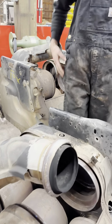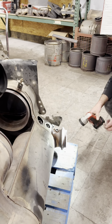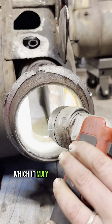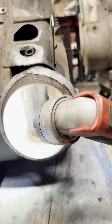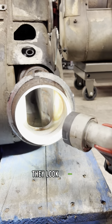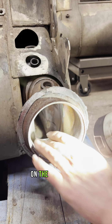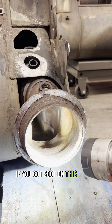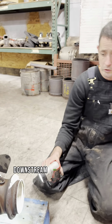Coming around now with the flashlight, you can actually see the outlet of the SCRs down here — it's kind of hard to get light in there, but they are back about right here. These particular ones look normal; they're nice pearly white with no soot. One of the other things to look at is the outlet here — it should be pretty well clean. If you've got soot on this outlet, then you've obviously had pass-through through your DPFs, which can cause issues downstream with the SCRs as well.